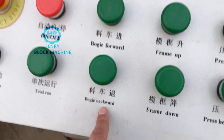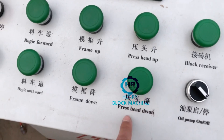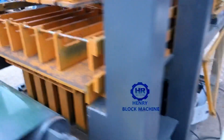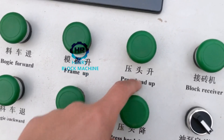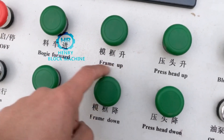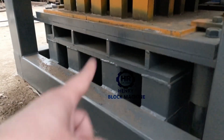This button is 'material cut go back.' After you feed in the material and check the soil is filled inside the mold box, press 'head down' — the top mold will go down to compress the blocks. After pressing, if you feel the bricks are formed well, press 'head up' again. Then press 'frame up' — the mold box will be lifted up by the hydraulic cylinder from the bottom.